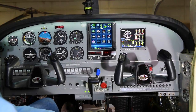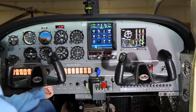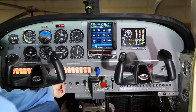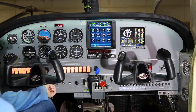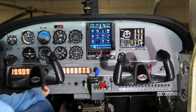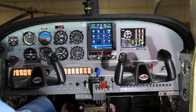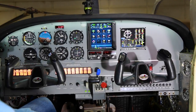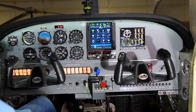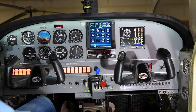We have floods that flood the whole panel, and the rocker switches are lit as well — you can see those turn up and down. We also have LED lighting for the gear indicators. We had a light installed so that any time the hydraulic pump is in operation a light comes on to let us know if the pump is running, so if we have a gear that is leaking and the pump is running intermittently, we'll have a light that alerts us to that problem.